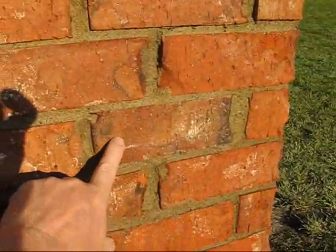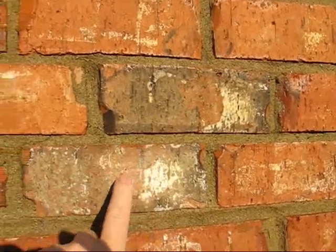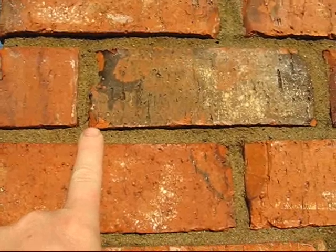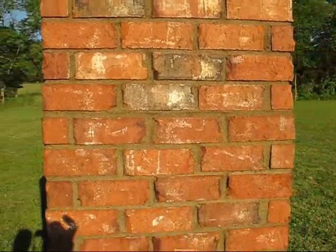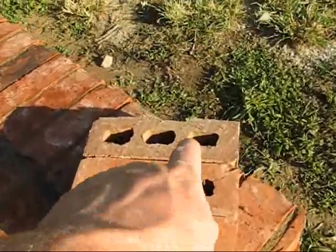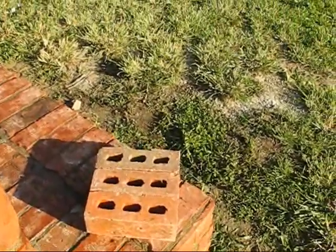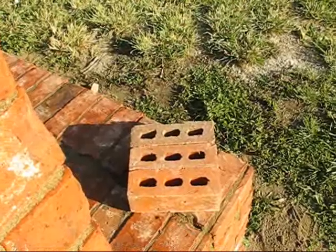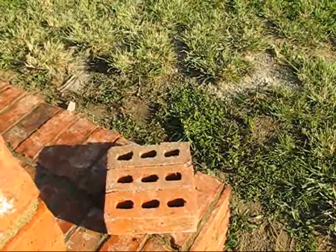Don't confuse a dark brick with a dark finish. This one just has something spread on the outside — the brick itself is still light orange underneath. It's the actual color of the brick that's your telltale sign of how much it was cooked. Next time you see a big wall on a commercial building, lean your head back against it, look up the head joint, and see if it runs straight up or wiggles like a snake.